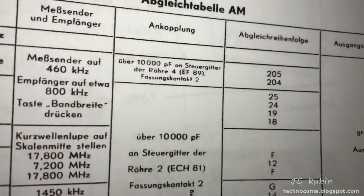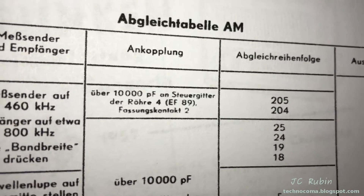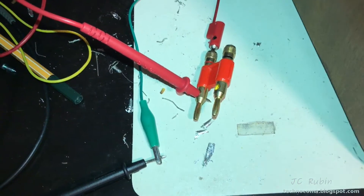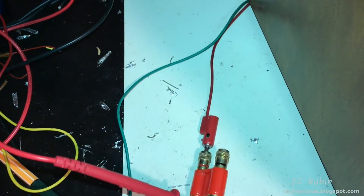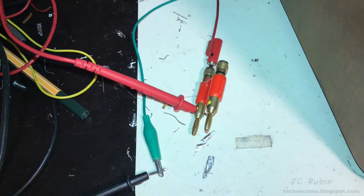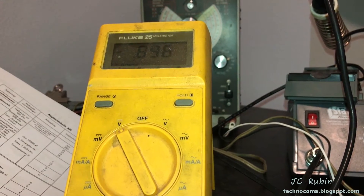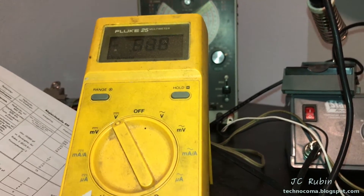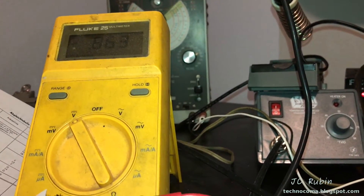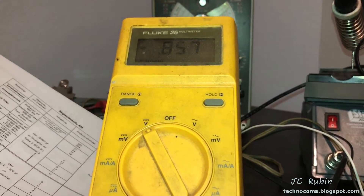I've got the whip coming out the back, everything tied down so there won't be any shorts, and now I can follow the rest of these instructions. The second EF89 ties into the ECH81, so we're just focusing on this first piece. Before I do anything, I want to make sure there's no appreciable voltage coming off that tube — I don't want to kill myself over this. I've got the Fluke connected and I'm doing a quick voltage test. Less than a volt on this, so we can work with this. When I touch my finger to it more frequently I can hear it in the speaker, so there's an interaction here.